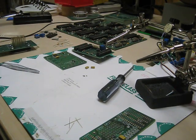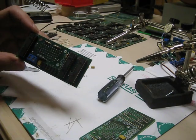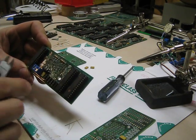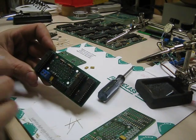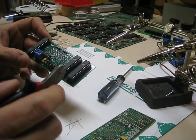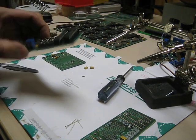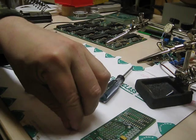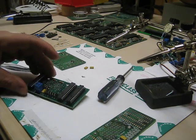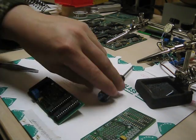You want to check your chip orientation. Before you wire it up, make sure your chips are pointed in the right direction. The little notch on the top left side is pin one, and on the boards, Scott has a little O shape — that's pin one. Make sure you've got your sockets pointed in that direction, and when you put your chips in, also pointed that way. If they're not, they will burn out or cause damage. It's a common mistake, but if you double check before you apply power, you'll probably catch it and save yourself a lot of headache.